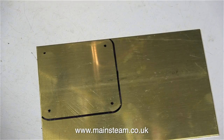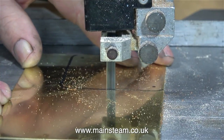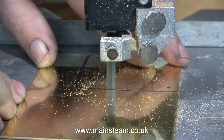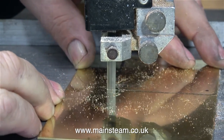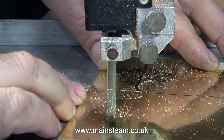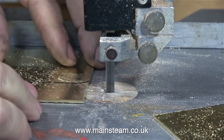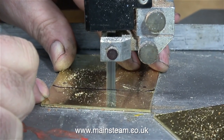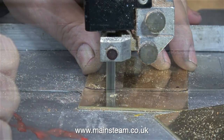But this is a much quicker method. Here's the shape I need to cut out using the bandsaw, then I need to drill some holes where the black spots are. So it's over to my old bandsaw, and at the moment it's got a very blunt blade, so I'm actually having to hold this at a bit of a strange angle, but as long as the blade follows the line, that's okay. I hold the metal plate at an angle when I'm cutting it, to suit where the blade is wandering to.